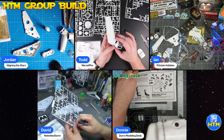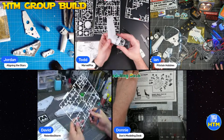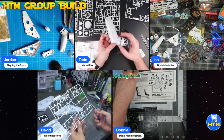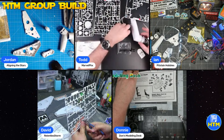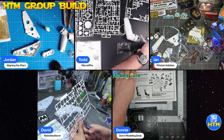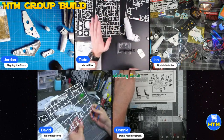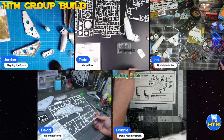So do you guys have a recommended power supply? Because I don't have one for my... I don't know. Mine is by Roxy, but I'm pretty sure that company existed for like a month. I have a Wampatec. Yeah, but it's take a bunch of Scrabble tiles, throw them on the floor, and that's the name of the company this week. So it's just some random one off Amazon. Yeah, the biggest thing that you probably want to get is make sure it has a separate on off button for the circuit. That is so helpful. And make sure it has overcurrent protection. Yeah, they mostly all do.